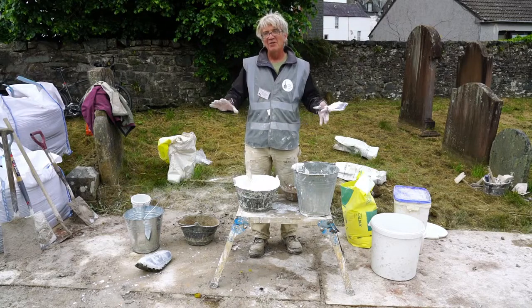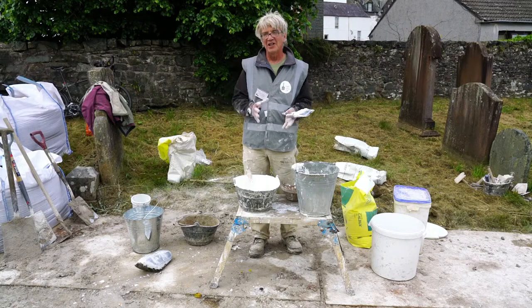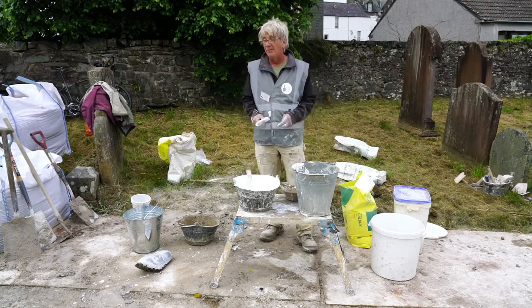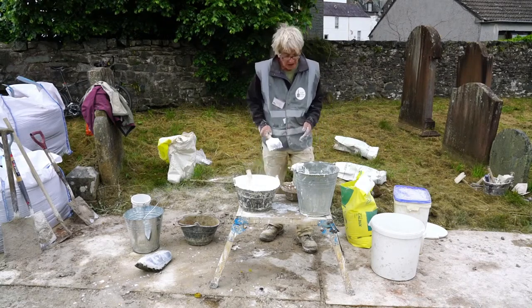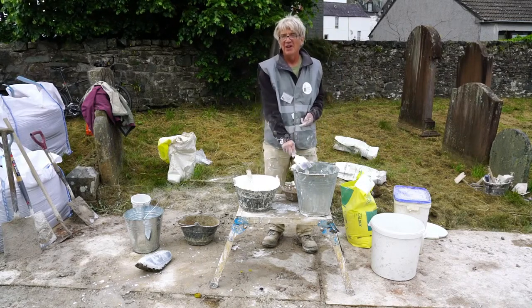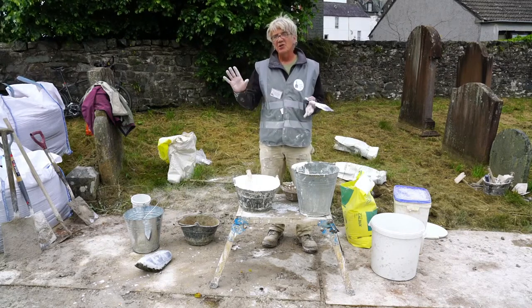This is not an insignificant factor in all of this, yeah? This is a social thing, and these things are going on. So anyway, that's a hot lime wash, simple as that. Get it on as hot as you can, and forget about water thin lime washes made out of lime putty, unless you just want to spend money. And it doesn't give you as good a finish either.